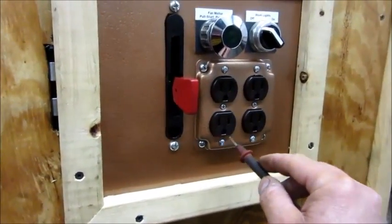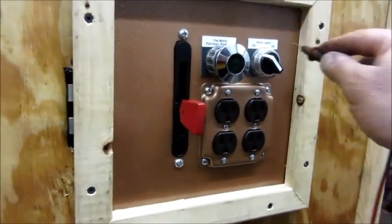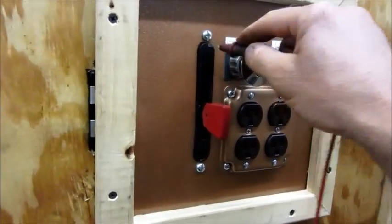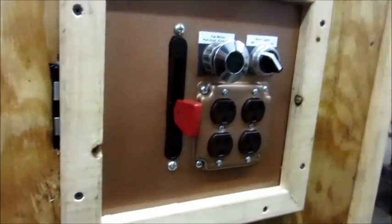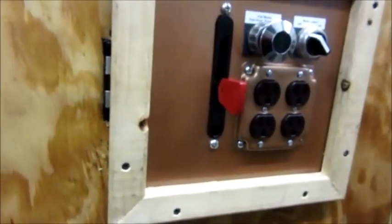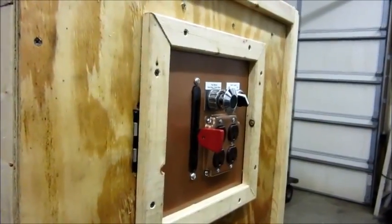Now that I've got the meter hooked up like this, if I touch something connected to ground I'll get the tone. Of course, the outlet ground points are good. The metal switches are grounded — that's everything up here. Anything that could maybe get shorted out and possibly shock someone is grounded, and that would make it basically trip a breaker instead of being an electrical hazard.